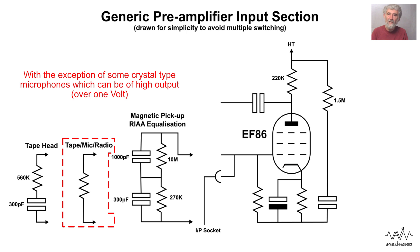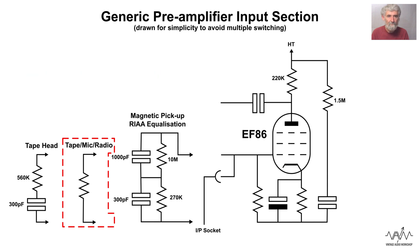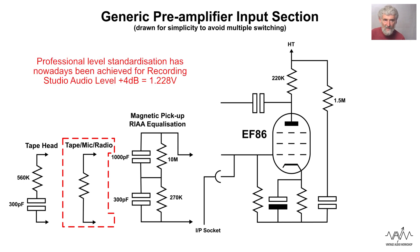Microphone needs the highest gain whatever type of microphone you put in, and therefore this resistor will be the highest value, with the tape input probably somewhere between. On some preamplifiers you are given a preset pot on the back and you adjust it for your particular equipment, because there are no fixed standards for the outputs of tape recorders or radios. Yes, in Europe there are DIN standards, and even those are somewhat variable - whether it's 50 or 100 millivolt. But if you had a professional tape machine, the output would probably be normalized for 0.775 volts - a great deal more than domestic.